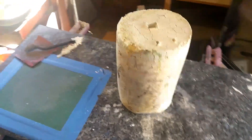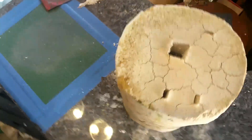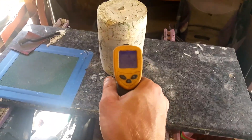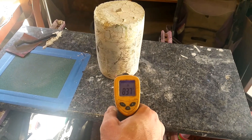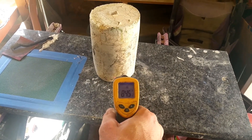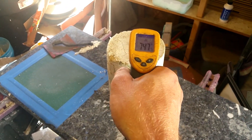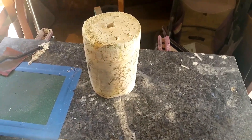The mold is out of the forge, out of the burnout process — basically done smoking. We're looking at 870 degrees down there, that's where it was sitting. Up here it's 700 degrees, just got out of the forge. So let's melt some metal and make the pour.